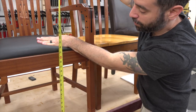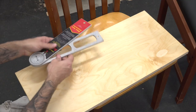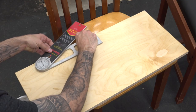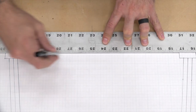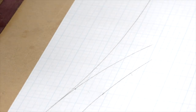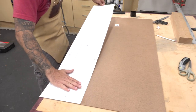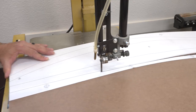Chairs have been around for a long time, so before I put pencil to paper, I used some other chairs as reference and extracted some important measurements. From there, I sketched up some full-size drawings, which not only helps me work out the details but also gives me what I need to make the templates. The templates are made from eighth-inch hardboard, which is inexpensive, flexible, and easy to shape.